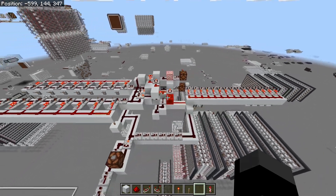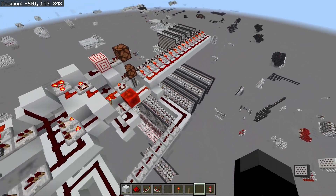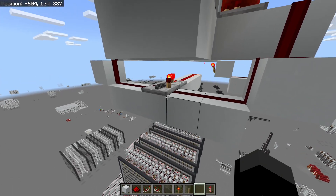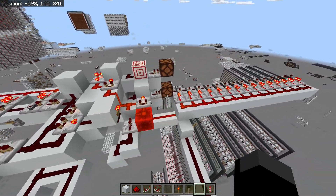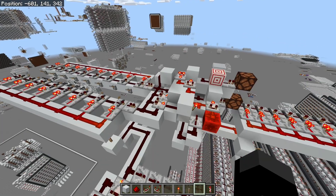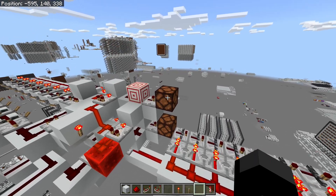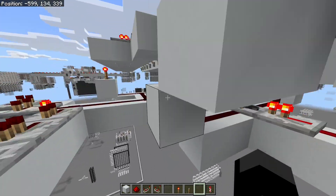Now let's see how this circuit works. Basically the circuit is made up of five different parts: we have our two input shift registers, our output shift register, this clock over here which clocks all the registers, and then the actual adder itself and this D flip-flop down here. What happens is when the adder receives the input signals it adds them and outputs the sum to the output shift register. However, sometimes when you add two one-bit numbers you can get a two-bit number — your first bit is saved as usual, but your carry bit gets sent into this D flip-flop and can be used in the next addition.